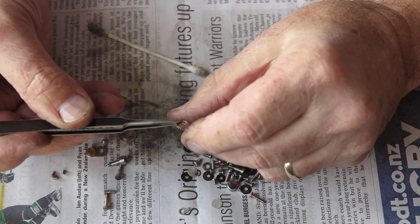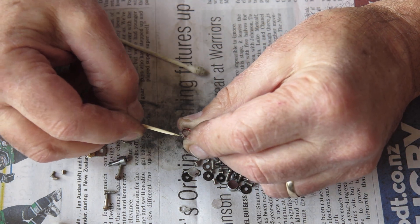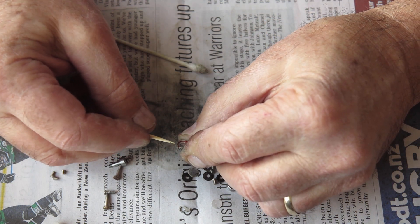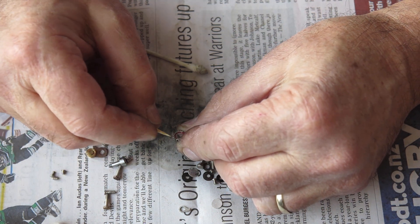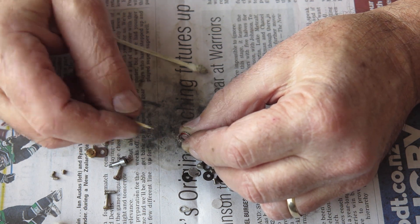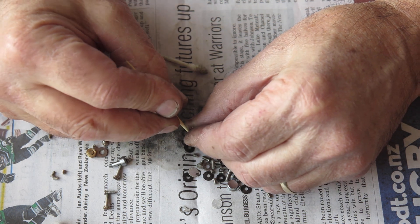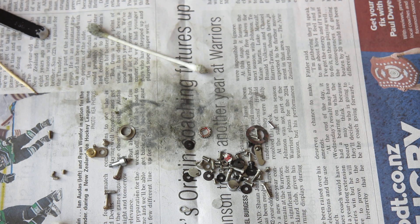This is the little gear from the top of the film advance — I need to make sure there's nothing stuck in the teeth and that no teeth are damaged. In cameras where a cocking rack has failed, you might have a damaged tooth on this wheel. If there's one damaged tooth, that won't necessarily cause problems because being squared off you can turn it to a different position on the shaft — it's usually fairly easy to rotate it so the damaged tooth never comes in contact with the rack.